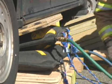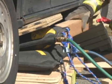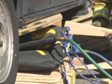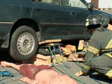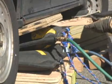Hold. The maximum we want to inflate the bottom bag is about 50%. The maximum for the top bag is 75%. Any more than that, and we get into a pillowing effect, which can cause a very unstable condition. Ideally, we want to leave the bottom bag slightly softer and the top bag a little more firm. This allows the bags to nest together, bonding so they won't slip out.